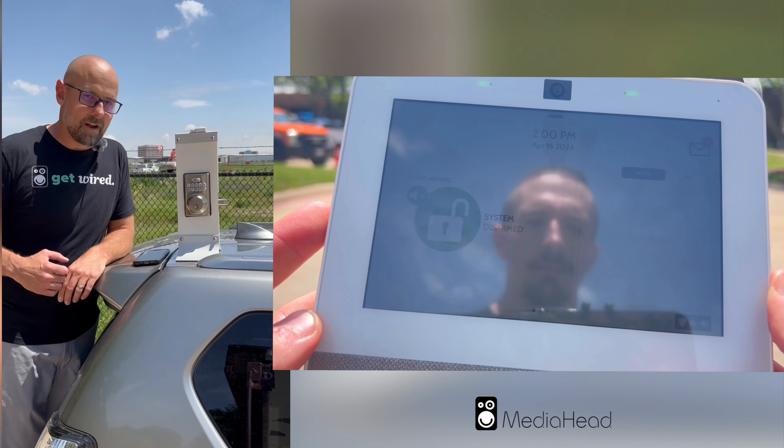So media heads, what I'm going to show you here will emulate our front door. This is a wireless door contact, so when that opens and closes it should communicate to the panel, and we have our wireless PowerG lock here. When your security panel is counting down, it expects you to open and close an exit door — a front door or garage door — and that's how it knows you've left. Otherwise, if that open-close action doesn't happen, it arms to stay, which results in a different set of actions on the back end when it comes to an alarm.